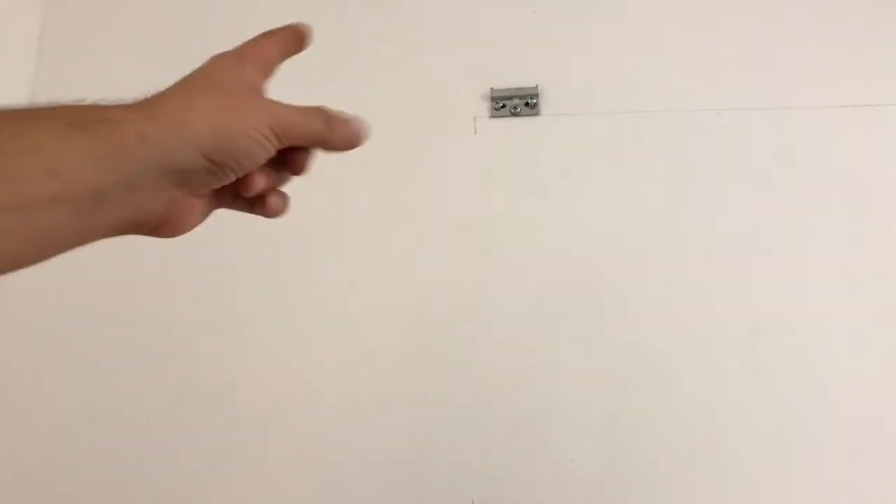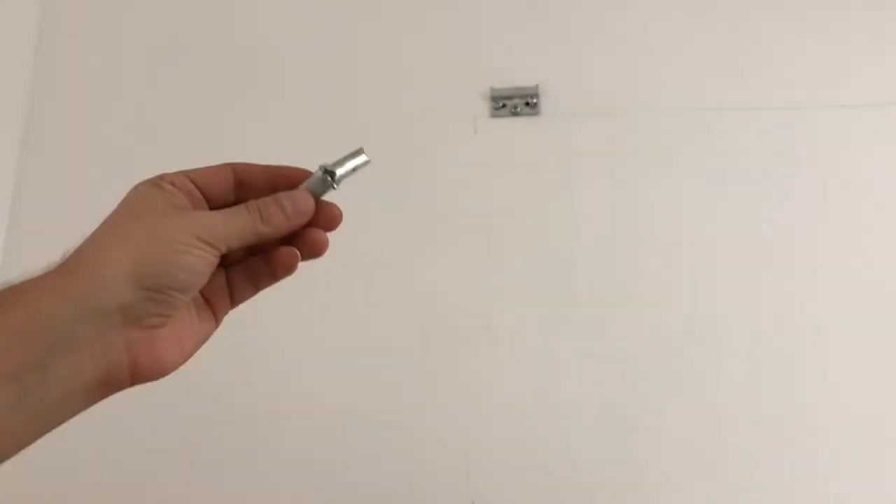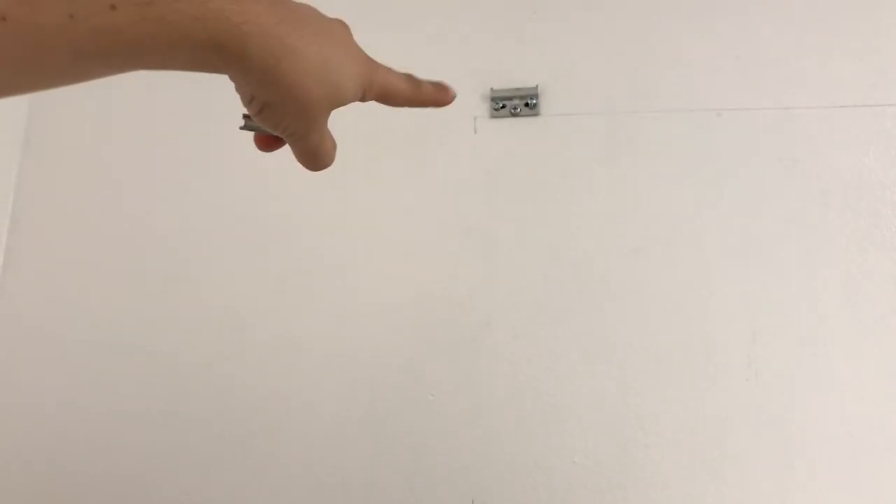Don't over-tighten toggle bolts. You're using a drill to pull the screw in, and if you over-tighten it, the toggle will strip in the wall, leaving a gap and extra work. You can get it out but you don't need that hassle. My back hurts and I'm going to surgery soon, so I don't need to deal with that. Just tighten it enough to hold — unless the mount is going to get serious vibration, then I'd look for studs and build a secured system.